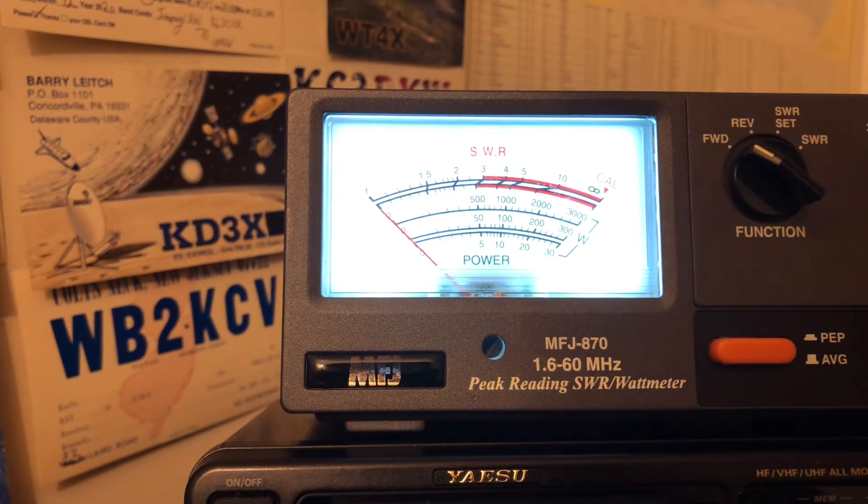While we're here, we're going to put it on forward, which is going to measure average power. We'll see what the radio is tuned up to. Just over 4 watts — maybe like 4 and a quarter, so just about 4 watts. It's pretty darn close. Right out of the box you're getting 4 watts of power from the President Bill, and that is on AM.